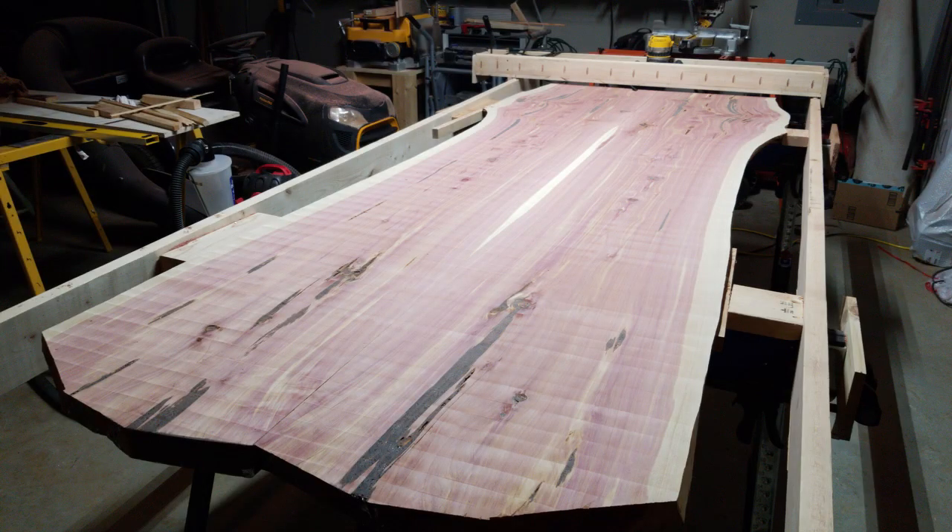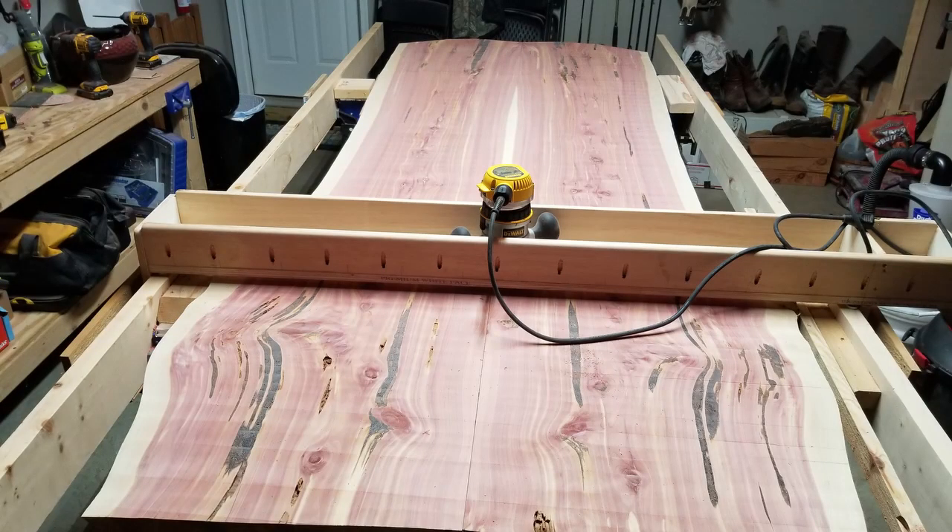This is a good time to point out that I had to use four low sawhorses. These sawhorses have fold-out brackets to place a 2x6 upright on its side so you can use it as a rail for a sled. I had to use four of them since this table was so wide, but they worked out really good. After a lot of shimming and leveling, it turned out perfect.